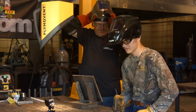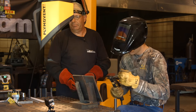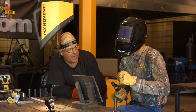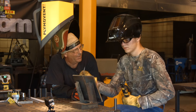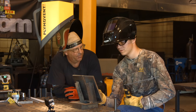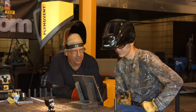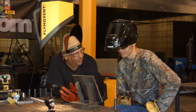Does that make sense? Sure. Let's give it a go — prop your left hand against something to stay steady. Remember, point the rod slightly uphill. We've got rod stubs — you know what we do with rod stubs? Use them for tacks, or burn them up on a hot pass. Strike up here, long arc here — about a half inch above. We're going to go back in and grind and blend that out anyway. The other thing I've seen is people strike an arc down in the groove where they're wanting to put the root, throwing garbage into the groove, and then you weld up to it and you don't punch through on the back side.